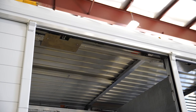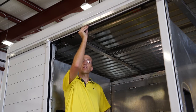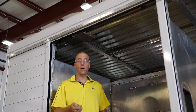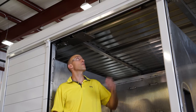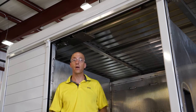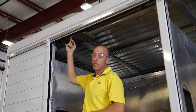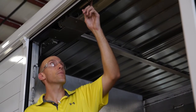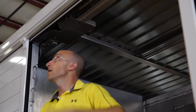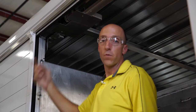If when you hit the button the door doesn't close all the way, it could be because the door is traveling down slightly and every time you hit the button the door has to go back up a little bit more. Things that can cause this are insufficient tension in the main operator or if the magnetic arm and the sensor reel are not free spooling. To fix this, add a couple of pre-winds to the main operator to increase the tension, and check that the sensor and magnetic arm are moving freely.